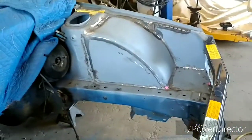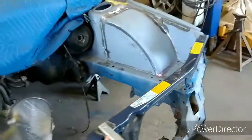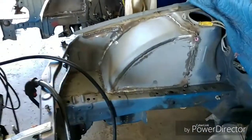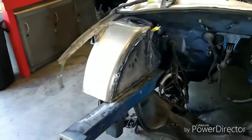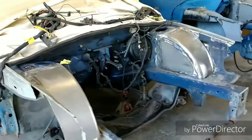After it gets all stitched up, go through and make sure everything is solid — basically make sure everything has penetrated the way it's supposed to. Run a light on the back side to make sure there are no pinholes, and then take a hammer to it. Make sure you don't crack any of the welds. If you do, fix it — it's not that hard. You've got a welder right next to you, you might as well use it.